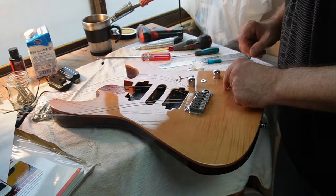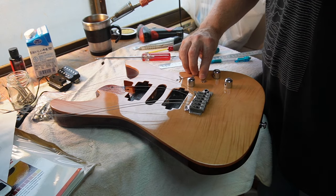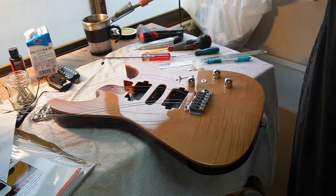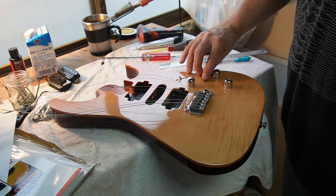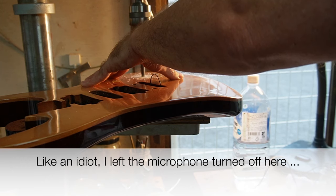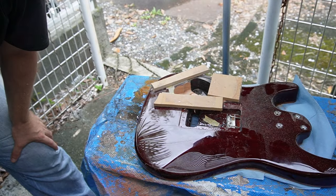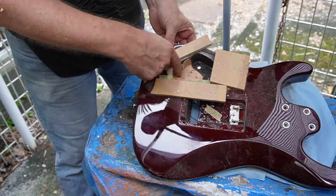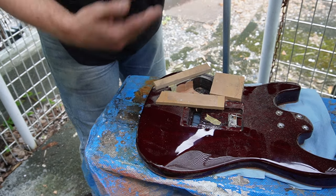There are lots of options for where to put things. I've decided I'm going to have the knob for the piezo control about here, just a little bit behind the bridge, and then the switch to control them will actually be halfway between the volume and the tone knob. Part of the reason is the previous Fusion 2 actually had a switch here — it was then replaced by a push-pull — but there's space for the switch to go into the cavity and I only need to route out a little bit extra. Now for the slightly scary job: routing out the cavity. I've already hogged out some material with a Forstner bit, but I'll route out the rest, then do the lip, and then make a cover.